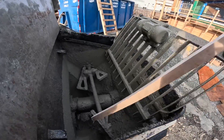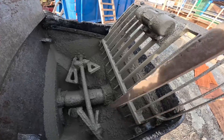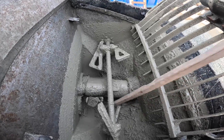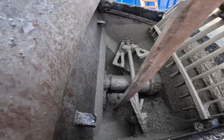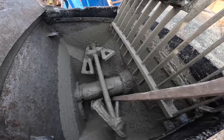And please, please, please, don't ever put your hands, arms, any extremities in the hopper. Ever, ever, ever. Even if the grate is up, the e-stop is pushed, with the truck running and the accumulator energized. Just do not, do not, do not. It ain't worth it.